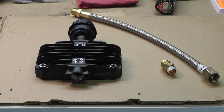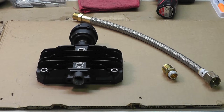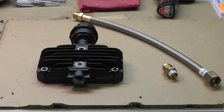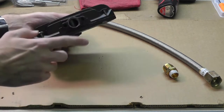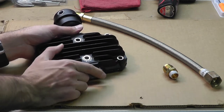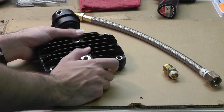Essentially, this is a workaround. It's a really nice, more heavy duty, more permanent solution to your transfer tube problem, where a lot of times you'll have a rigid transfer tube — copper or aluminum — coming out of the discharge of the head and it kinks. Vibration while the compressor is running causes kinks and causes all kinds of leaks.